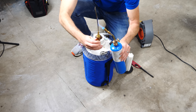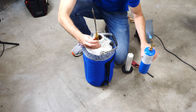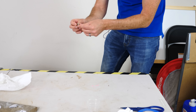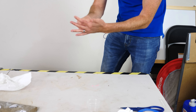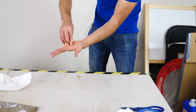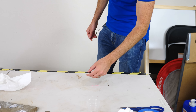When you heat it up, it bends towards the one that has the lower expansion coefficient. You can get quite a significant amount of energy out of this as well. I have a coin here that has two dissimilar metals adhered together. I'm keeping it warm in my hand, and when it's warm it bends one way. But if I set it on the table, it cools down and it pops up.